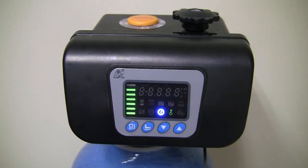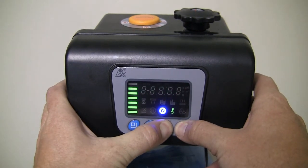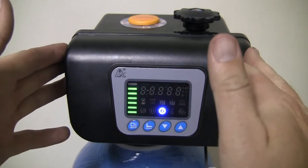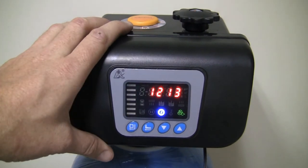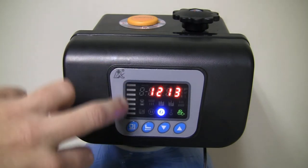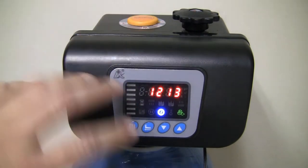To unlock the valve head in order to do the programming, you just hold down both the up and down button until you hear an audible beep. Now the valve head is unlocked. To enter the settings, press this little set button once. The little spanner icons come on showing you that it's ready to be programmed. You can also see the little progress bar is stopped, because it's not in normal operation — it's frozen while you're doing the programming.